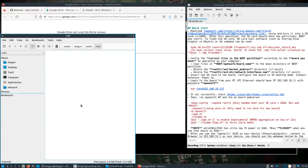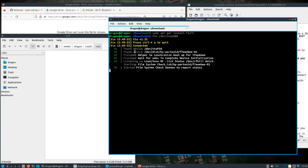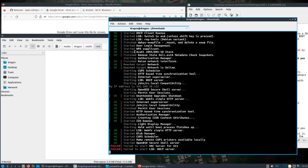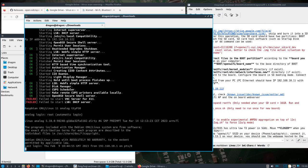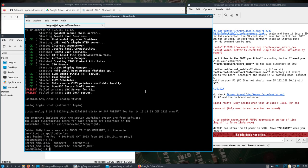I have the E200 sitting here with a network cable in it. I'm going to try to connect over a serial connection because ultimately I want to change it to a DHCP address that the AntSDR is pulling. I ran sudo apt install tio, so let me try that. Now this is easy for me to use. I can see the device booting up and I see the address 192.168.10.122 which is mentioned in the documentation.